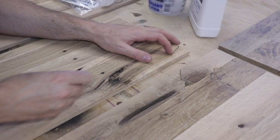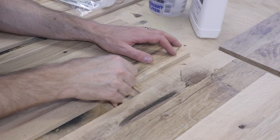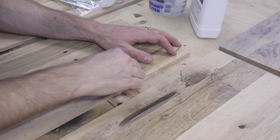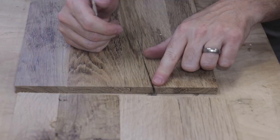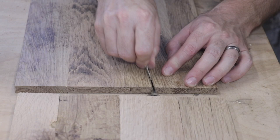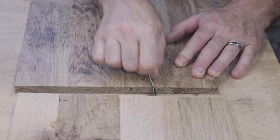Some of these are pretty hard to get to just by the nature of the holes in the wood. I think for the most part the structure of the panels is strong — I just don't want the cabinet to break apart later on at the site of one of these defects and holes. This check here actually goes pretty far down this panel, and I want to be able to get that epoxy down into that check to prevent it from opening up over time. So I'm just going to take the sandpaper and try to scratch the surface the best I can and then blow out any of the dust.